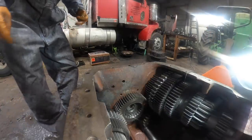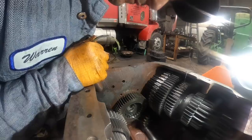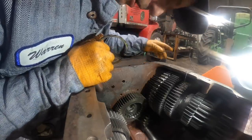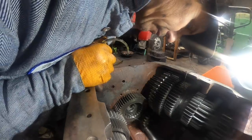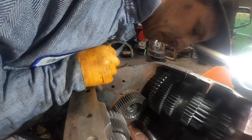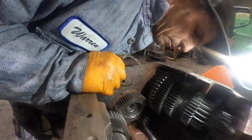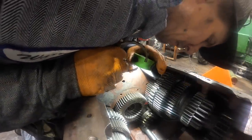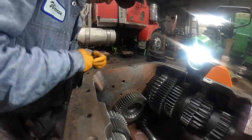Here's the snap ring, the spacer, and the drive gear. Mark two adjacent teeth, then mark the two adjacent teeth across from it with a paint marker — there are no marks on the drive gear, you just have to count them. Put the drive gear in and mesh it with the lower counter shaft. Looking lined up. Then put your snap ring in.